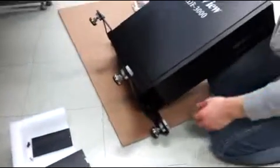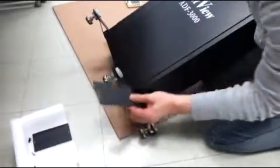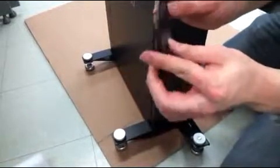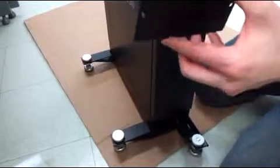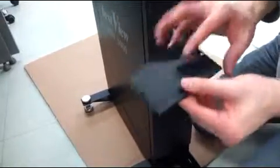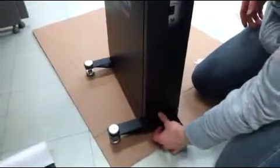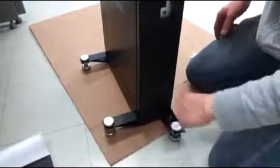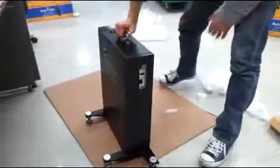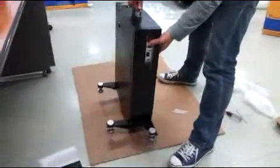After you put the level casters on the base, you have to close the sides again with these, and make sure, because they actually do have inside and out to the sides. If you look here carefully, the edges here are shaved off. This is the outside. You see how this is just flat? This is the inside. So make sure you place the sides back like this and screw the bolts in. Okay. Once you finish installing the level foot casters, the hard parts are finished.